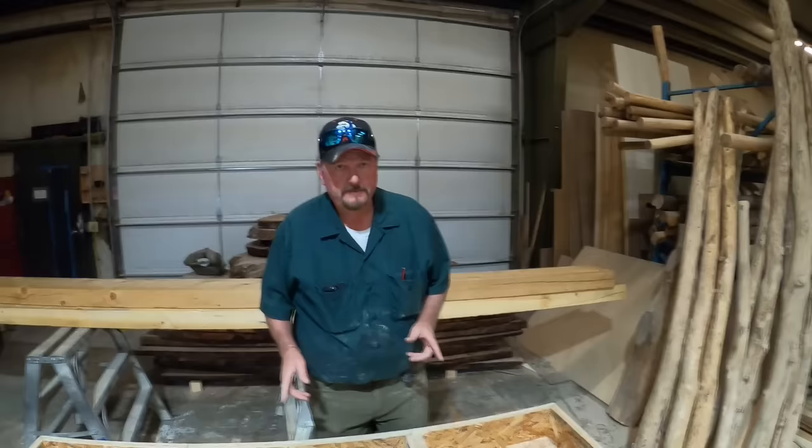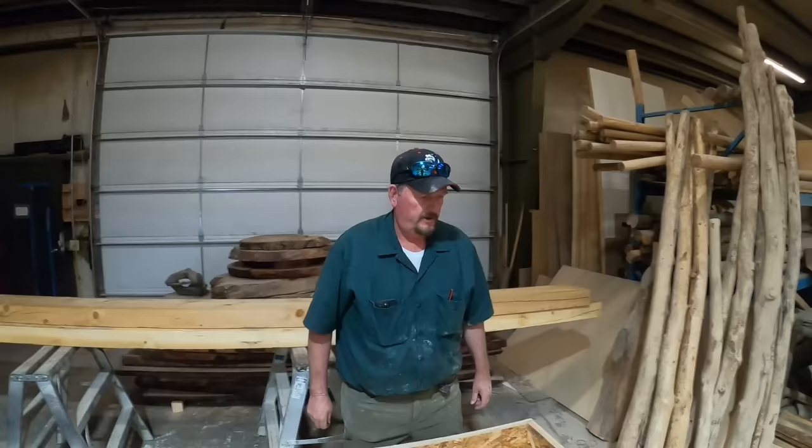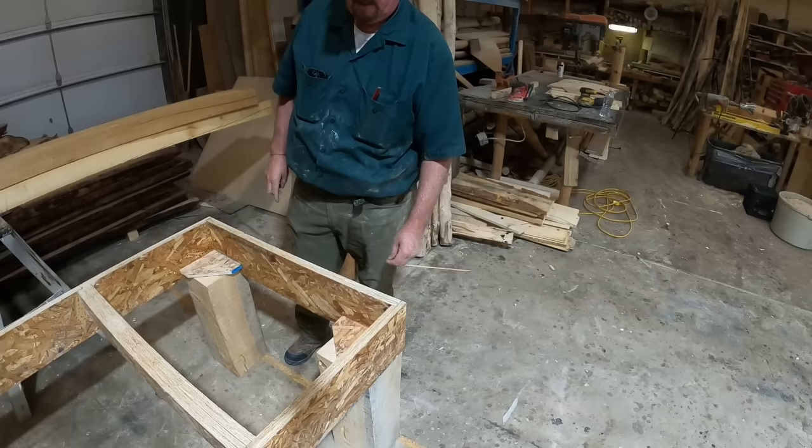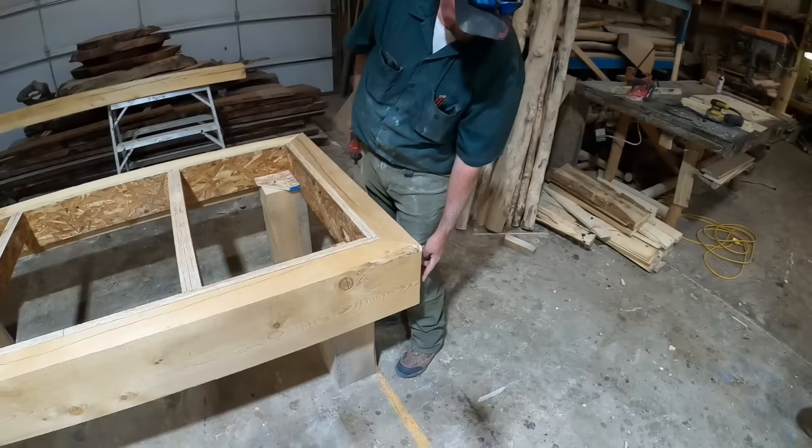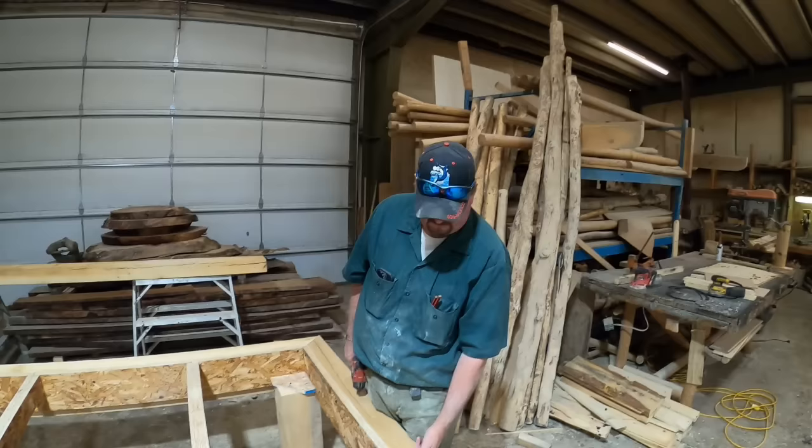We're going to take these 4x10s and cut a 45 on the four pieces. Then we cut out for the pockets. We've got all of our sides on. Miters look pretty good. Got a little bit of a gap on the bottom, but the beam was twisted. Once we cut this out, it's not going to really matter. The pocket's going to cover it.